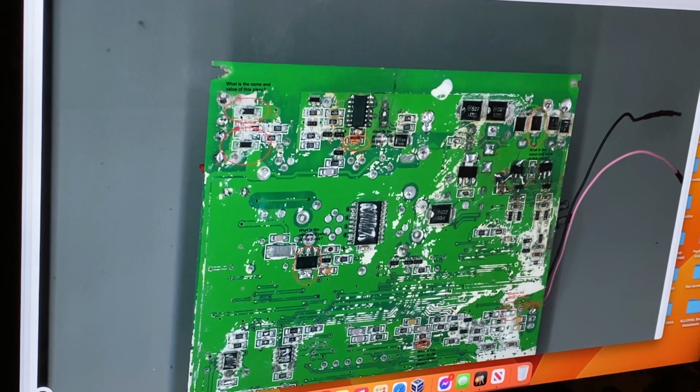So it could also be a 1 ohm resistor too. They can actually put in like 0.1, 0.2. I wouldn't go up to 1 ohm, but very low ohm resistors you could put in there, and that will cut a lot of interference, depending if they've got really decent capacitors on the other side, which they do. Any stray noise dropping across a resistor, even a low value resistor, into a hefty filter capacitor of, say, on this 1000 microfarads, will kill the noise.